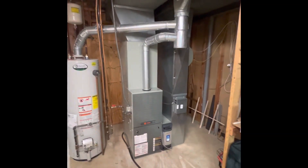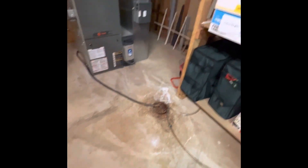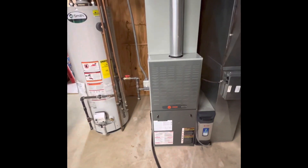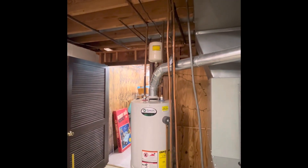We're in the basement of the Bravest residence looking at a possible full system replacement heat pump. Floor drain is about five to six feet away from the unit. Standard efficiency furnace, Trane variable speed on a two-story home. Got a six-inch existing stack back to a four and four for our water heater.